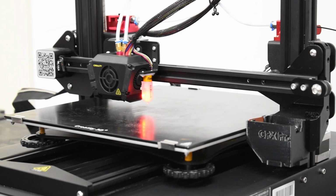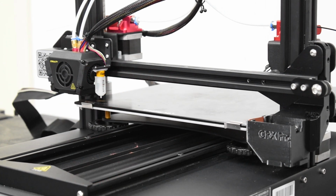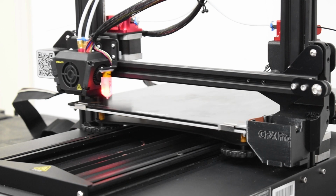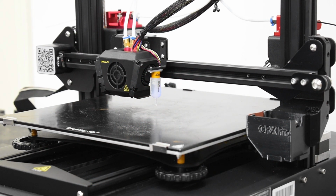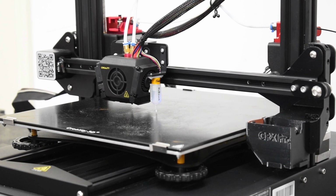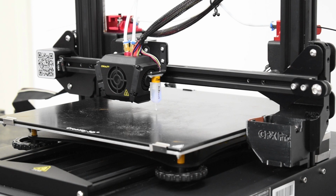As the auto home begins, the probe normally remains off, but it's okay if it's blinking and it will reset automatically. It's a good idea to place the feeler gauge under the nozzle while it homes to protect the bed if the Z offset value has been accidentally set too low.